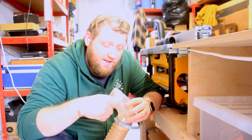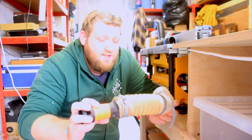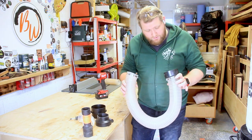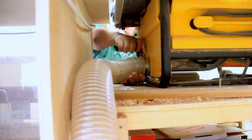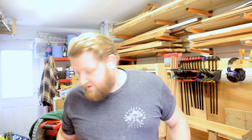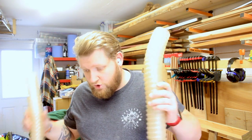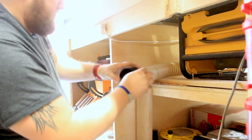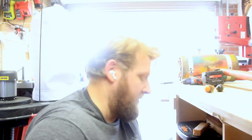I've got quite thick plastic here, which means getting things around this right angle is quite difficult. So I think what I might do this time is just use the flexible hosing instead. For a temporary solution I'm going to use the hose that came with the thickness planer to connect the back of my table saw to here. Done — okay, completely scratch what I just said because this is too thick. I need thinner, shorter stuff. I've reconnected everything, taking that big one off which is now useless, and I need to attach this to the other end. Let's attach this together and give it a test.